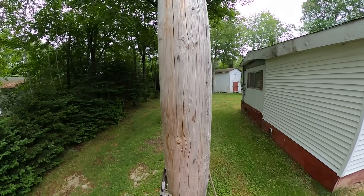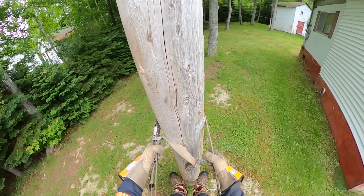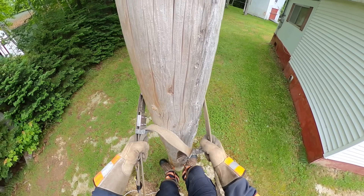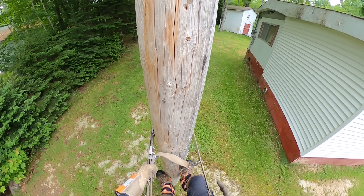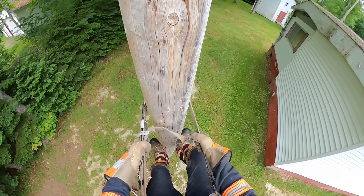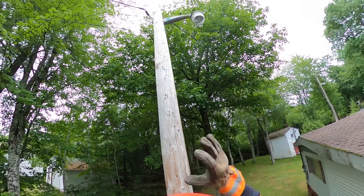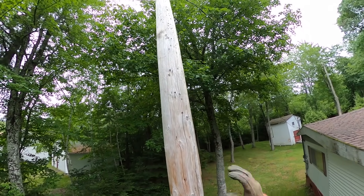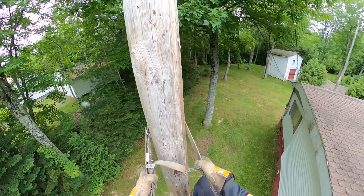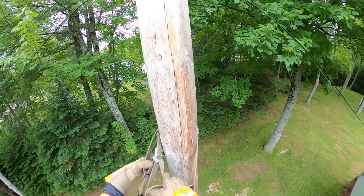You do want to be belted in at all times when climbing the pole, including when crossing over the communication lines. There are a few different techniques for climbing — one of the easiest is to take even steps with each foot: one, two, belt up. You don't want to take a larger step with your dominant leg as it will tire you out a lot quicker. So we go: one, two, belt up — one, two, belt up. Another technique is to belt with each step, but this is more difficult and tires you out faster, so we'll stick with two steps per belt movement.